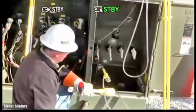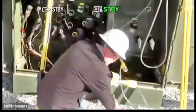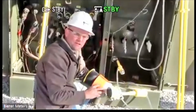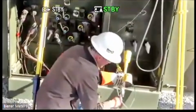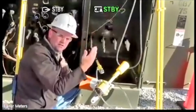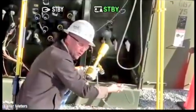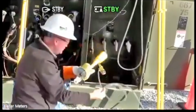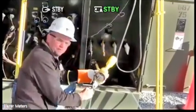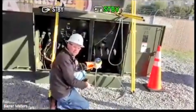Now, as I mentioned earlier, if you go with just an alligator clip to ground like this, you have to keep in mind that you have a ground potential right here at this cable. So if you're doing this in an overhead situation, what you can run into is if I have a ground right here and I'm working from a stick and I overshoot and go to the conductor, you have that ground potential. That's not a very safe method, obviously, right? Because I have no protection in this circuit, no second probe. If I use this scenario where I have 25 million ohms in series and I do that same thing, I attach to my meter probe and I overshoot and I go to a phase, I have some protection built into this circuit. So keep that in mind.